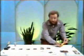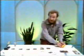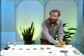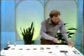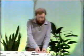And there, like that. When you've done that, seal it with some bathroom sealant or silicone rubber, or I suppose even Blu Tack would do, anything so long as you can make an airtight fit. Right, here's one with all that done. All we have to do now is to solder two of the transistor's connections to two of these wires here, and the receiver board is finished.